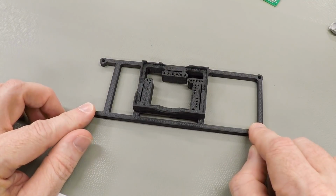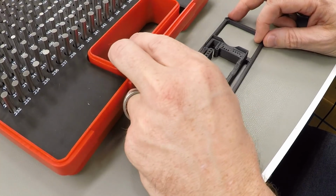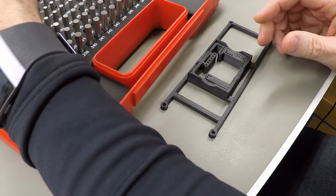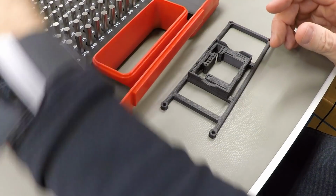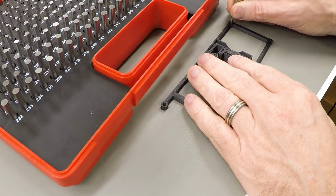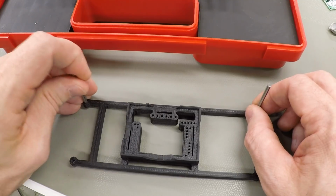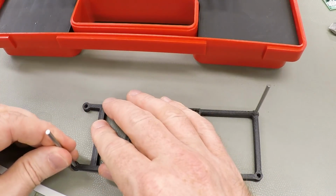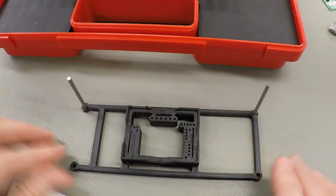So let's measure and see exactly how small the part is. I've got my collection of gauge pins here, and I'm just gonna find a couple that fit in the hole here. Way too small. Okay, that one fits pretty well. That's 121 thousandths. I'm just trying to find two pins that fit tightly enough that they retain in the hole. Okay, I think that's gonna be close enough.